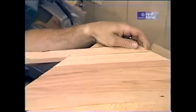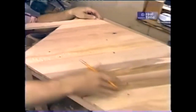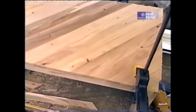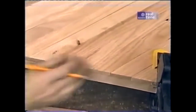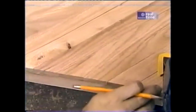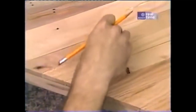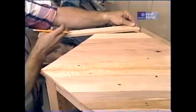Using the same techniques I used to fit the slats in the end panels, I've cut all the pieces for the top, allowing them to overhang the plywood backing by about a quarter of an inch all the way around. I've also taken some time to sort the different types of wood. I started with some oak, then this hardwood which I'm not sure what it really is but it looks a little bit like maple, then there's some cherry, another field of five boards, and I'm going to finish it all off in oak.